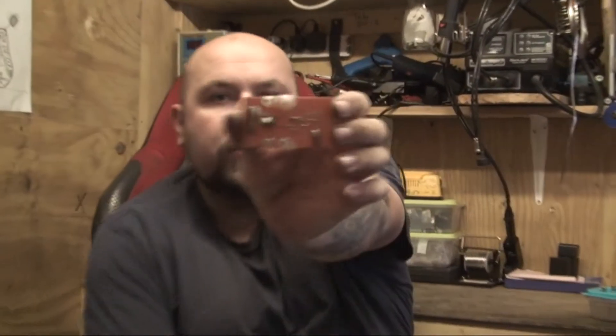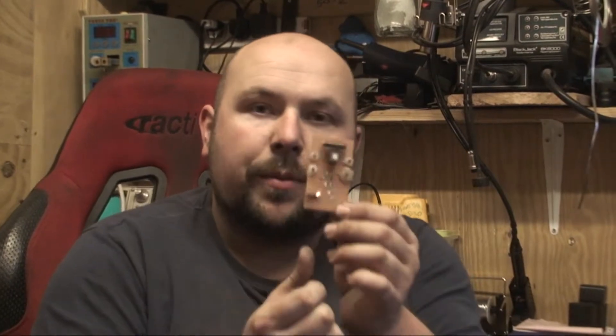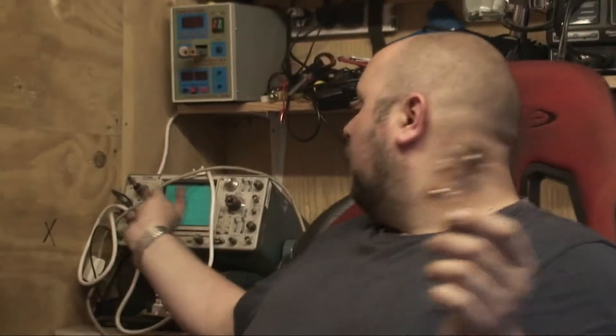Today, one of my first videos going back a few months ago, I was doing stuff with circuit boards and I made a component tester from another fellow on YouTube that I follow - Stone Slice. This is what we made, it's a curve trace tester. Basically, if you want to test a resistor or most electrical components like capacitors, you can put them on this, put them on an oscilloscope and it'll tell you if they're good, bad or indifferent.